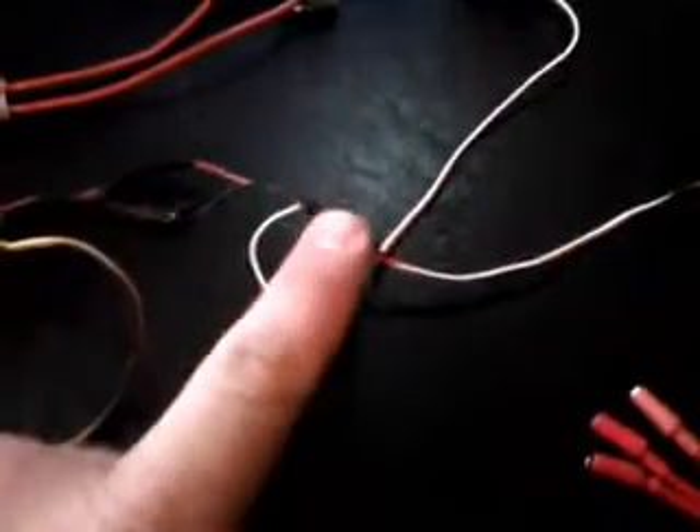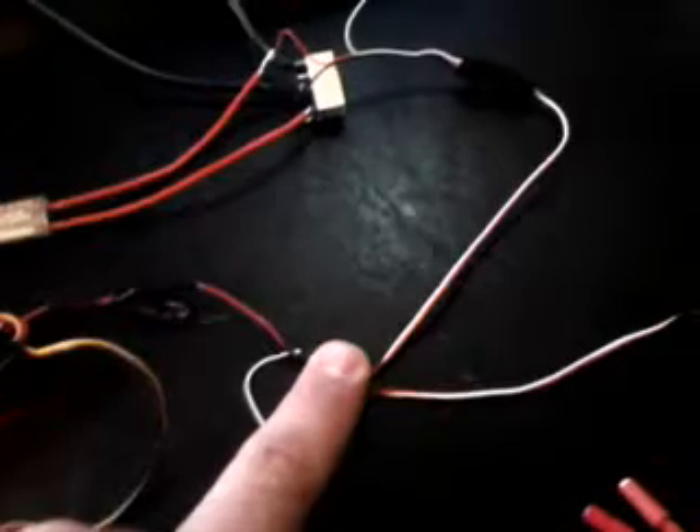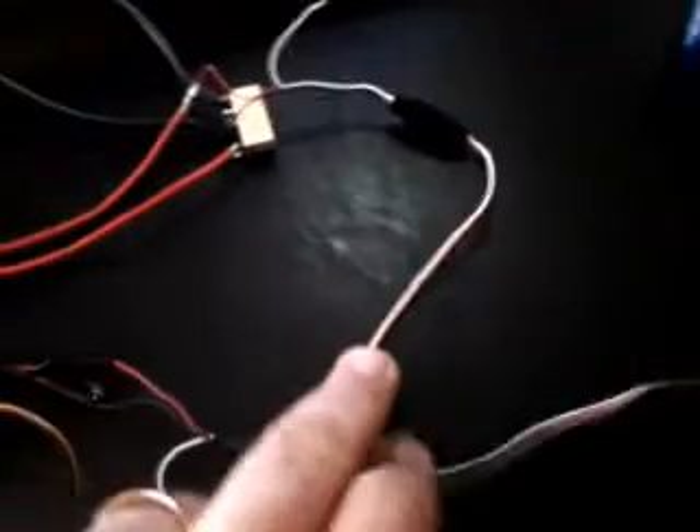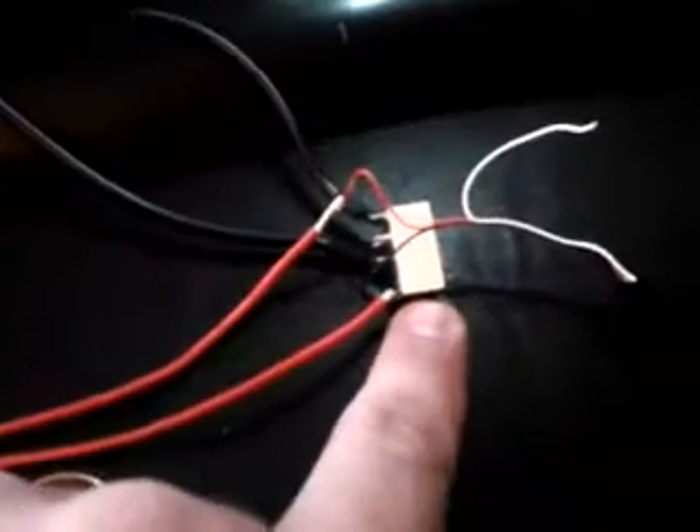So this is the simple part. You have a battery. Over here you have a speed controller that I'm using as a BEC. So the energy goes around here to these wires. This was a Y cable that you normally use for servos. The secret is right here — because at the exit of the 5 volts here, you're using the same ground both to a relay, a 5 volt relay. That's an example you have on the Hobby King site explaining how to do a remote plug. So 5 volts to the relay and 5 volts to the receiver.